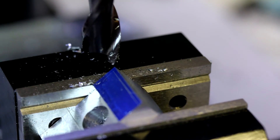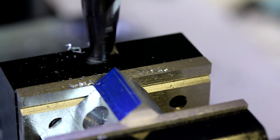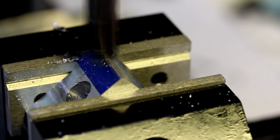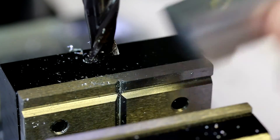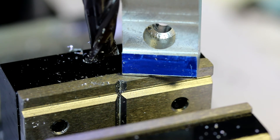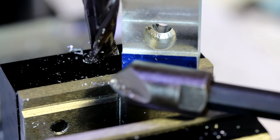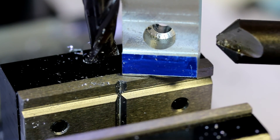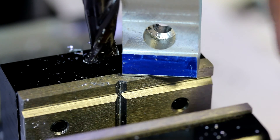I was going to take this down with a hand file, but might as well do it in the mill since we're already here. I just set it at a rough 45 degree angle — I didn't actually measure anything — and the exact dimension doesn't matter, I just want to take that edge off. Before we do a test fit, I'm going to deburr this hole so we don't scratch anything. For deburring holes the easiest tool is a chamfering tool like this — just a hand-driven tool. If you don't have one, you can just use a drill bit. This one has a handle and is quite sharp at a 45 degree angle.